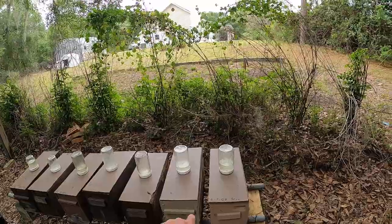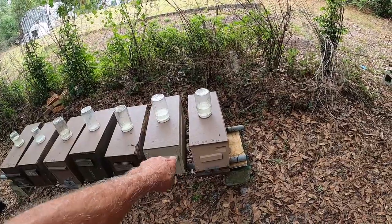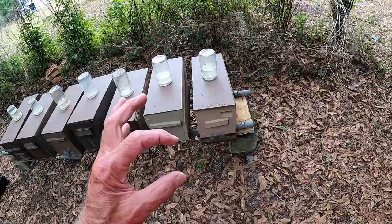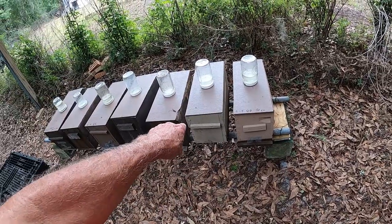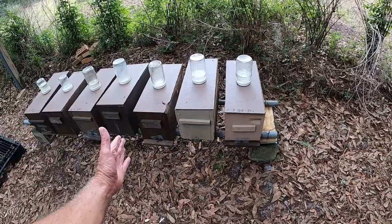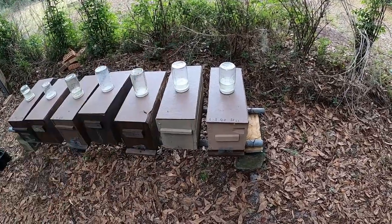It's very simple on these boxes too, because I start at the top and I really don't have to measure anything, but I just go all the way down, and at the bottom, whatever's hanging out, it could be that much pallet wood or it could be that much pallet wood hanging out. I have my table saw fence set up at 10 inches, so I flop the top down against the fence and push plow it right through the blade, and it cuts off the bottoms perfectly 10 inch.